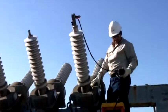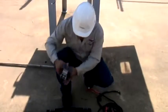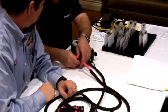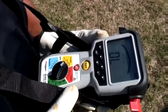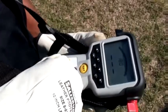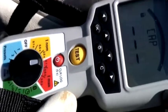Can the DLRO H200 provide the performance you need? You be the judge, as the DLRO H200 packs a powerful punch, giving an initial test current up to 240 amps, auto-ranging from 1 micro-ohm to 1,000 milli-ohm. This extensive range makes the DLRO H200 a great product for low resistance testing.